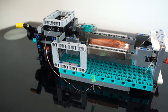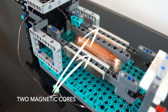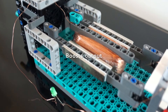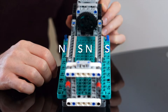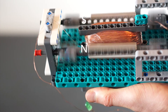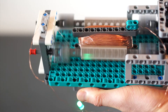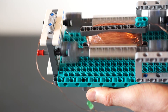The mechanism itself is very simple. Initially I only had one spinning magnet core inside the wire, but I decided to double up and use two so that I could pass a magnetic field on both sides of the wire, forcing more electrons to flow — this effectively boosts the output quite a bit. The magnets are situated north-south-north-south on each lift arm core so that the two cores are attracting each other. This ensures that one side of the wires is receiving a north pole and the opposite side is exposed to a south pole. Because the wire changes direction as it wraps around the Lego, both sides are pushing electrons in the same direction around the loop, which boosts voltage production.